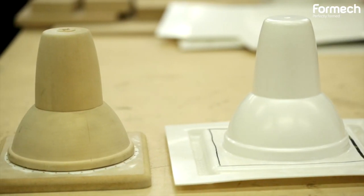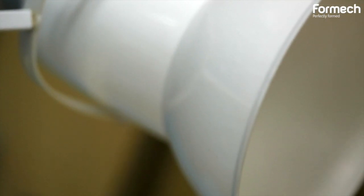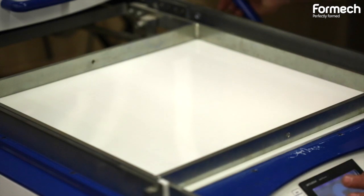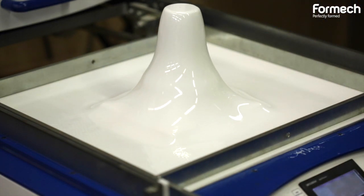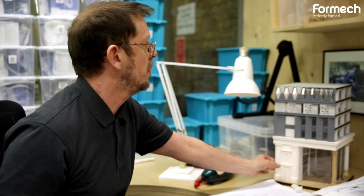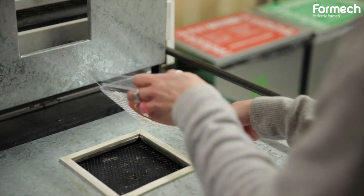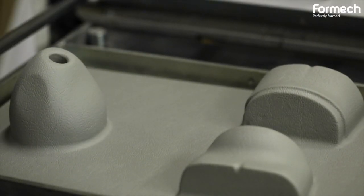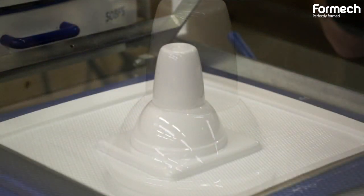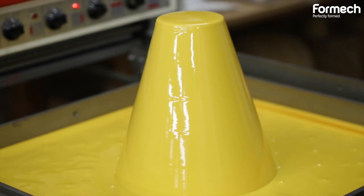The base components have been produced using a vacuum former, as has the lamp shape. The original of these would be a wooden plug, typically produced using Jelutong, turned on a wood lathe, and then that would go on to the vacuum former. This is another example — an architectural model — where this section has been produced using vacuum forming. The advantages of it are that it's fast and you can produce large objects with a hollow section effectively. Another way we might use them in non-traditional ways is for the fast production of moulds.